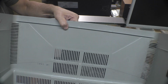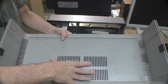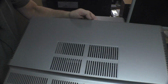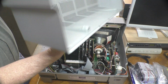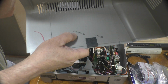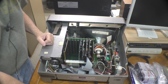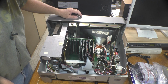This is large and relatively thin for its size. As the plastic cools after it's injected in there, it's going to cool at slightly different rates. It can cause stress like that, and after 40 years of this guy slightly shrinking as plastic does, it can increase that stress. Sometimes you can get cracks that way. I just noticed on here that this says September 2nd of 81. This is October 21st of 2023 as I'm recording this, so it is what, 42 years and a few weeks old.